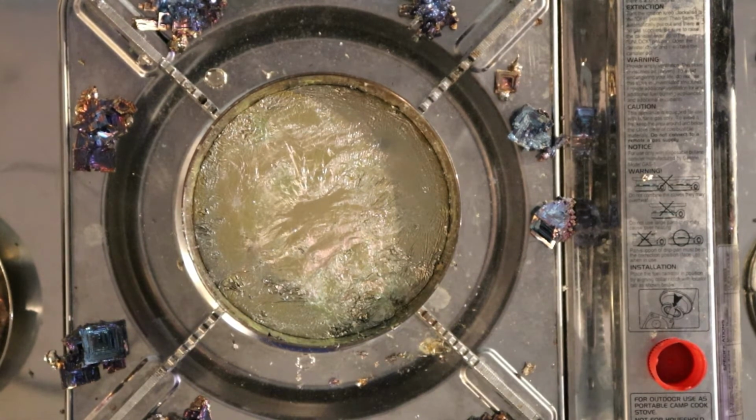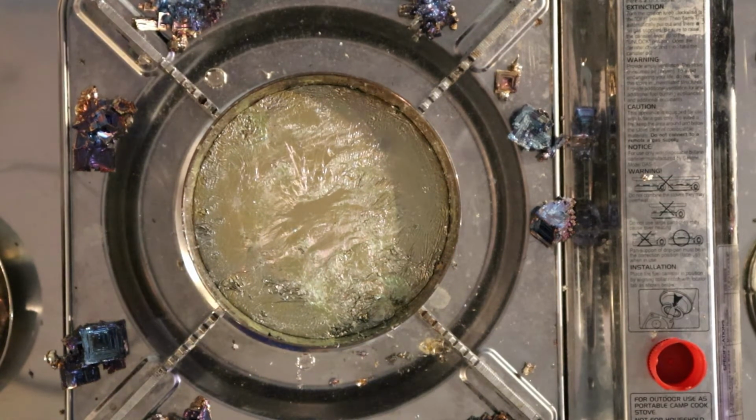But I think that it might lead to prettier looking crystals when I pull them out, because I think that the thinner the oxide layer is, the more saturated the colors are, and having a layer of other heat transfer fluid on top of the bismuth crystal would make it oxidize much more slowly before cooling down.